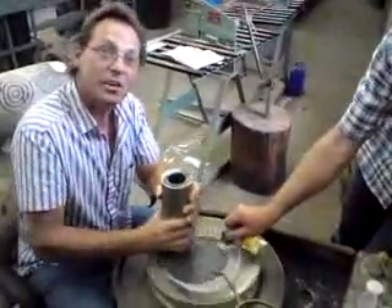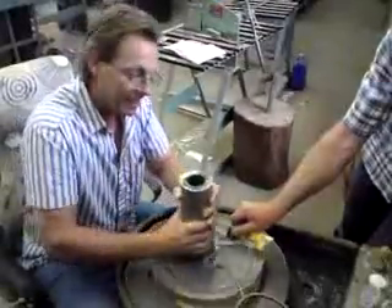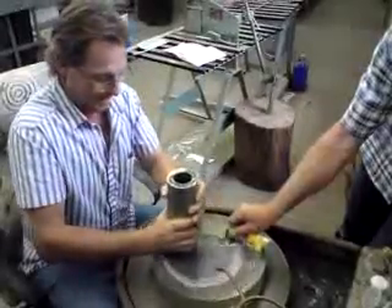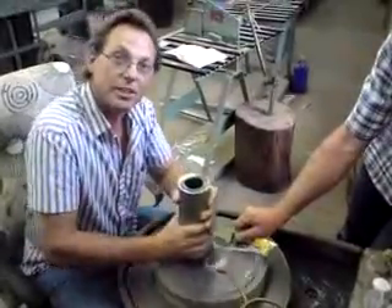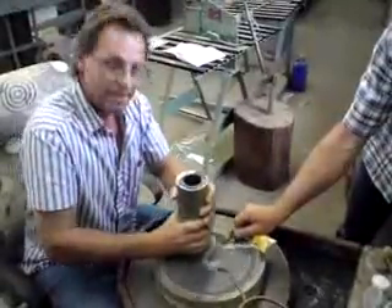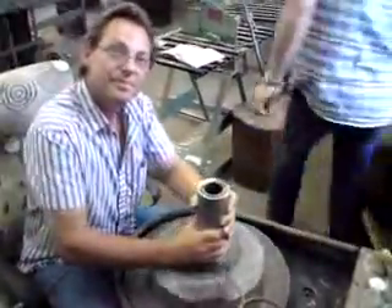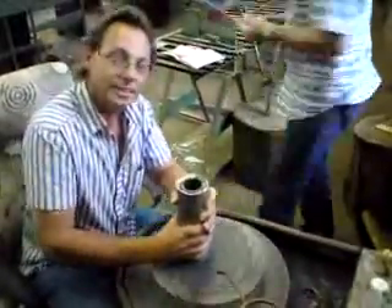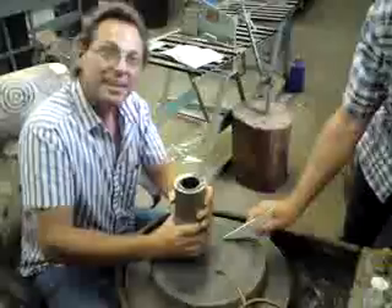I see that you're concentrating primarily in the central portion of the glass. Obviously we're trying to hog out the center so that we can eventually keep it. At a later stage we'll use a larger tool and a finer grit to eventually get to the correct shape. So once you've hogged it, you not only have to still get to depth but you have to smooth out the curve so that it's actually a sphere as opposed to some random kind of thing.